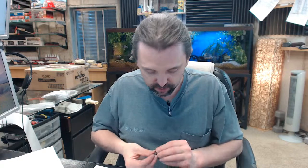So this is a very handy item to have, whether you're installing original equipment with it or if you're doing other locksmithing sort of related door and hardware installations. They're handy to have. So when you buy one, you're going to get one pair of tabs, this packaging, and it's the way that I've seen it, you're going to get four of the 12-24 screws, and then two of the 10-32 screws, which are down here for holding the lock body on to the tab itself.